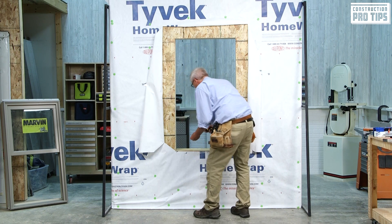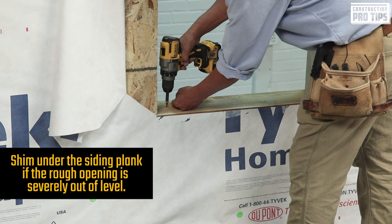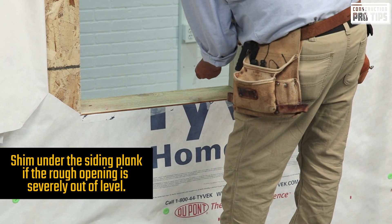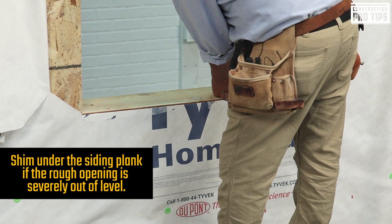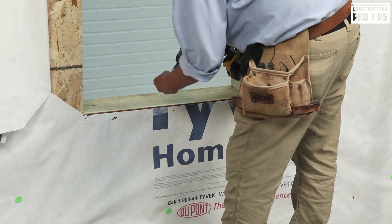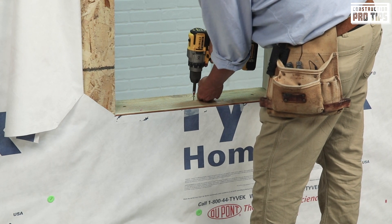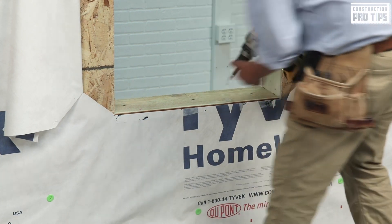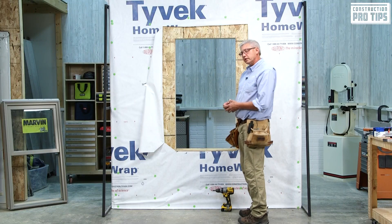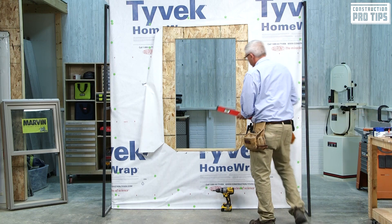The manufacturer calls out a two-inch galvanized roofing nail or equal. I'll put two fasteners in there to hold it into place, and depending on the length, in intervals of about 15 inches. Next, we're going to make sure we check it for level — I'm going to use the level to check that.